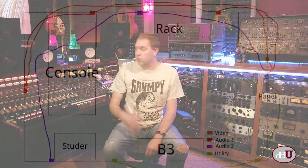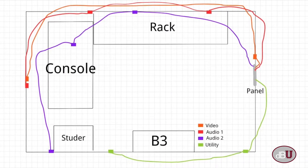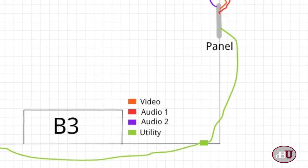So are there ways to make home studios work using a daisy chain system? Yeah, it's possible. My room here is not on an IG, but when I designed it, I was very deliberate in circuit placement. Two circuits were dedicated just to audio, two for lighting, and a couple for utility. To keep the room truly quiet, I had to be sure that only audio gear was dedicated to the audio outlets. I would be lying if I said I never cheated and plugged gear in the wrong circuits before, but to date I've been pretty lucky.